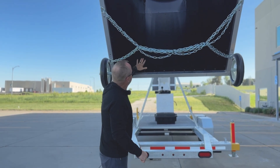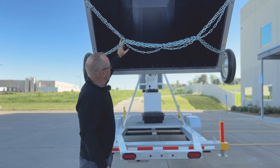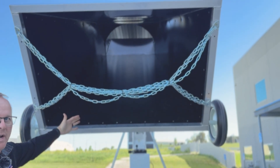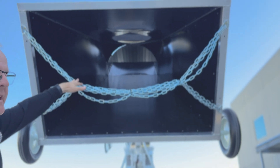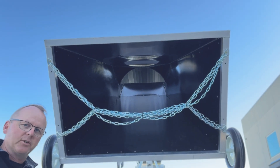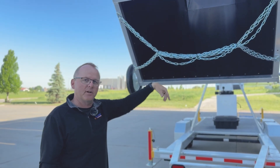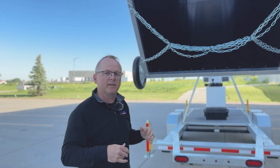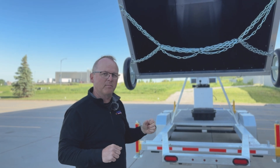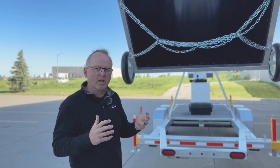We get asked a lot about clogging. The choke point at the top is 29 and a half inches wide. As long as the debris gets through that opening in the upper hopper, the chute sections all widen out as it goes down — 31 inches wide, then 33, then 36 at the bottom. That way, if the guys have a piece that's too big, they're going to know it on the roof and can change it up or cut it down.